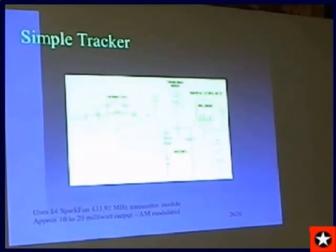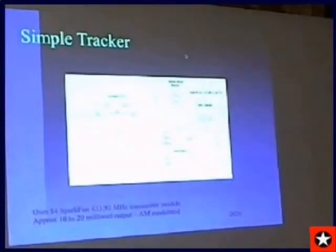Now the next thing is, I use a Kenwood TH-F6A to receive it with an arrow antenna on the ground, all you need. It does take a little bit more gain, however. That's the only drawback. I can also key it on and off as Morse code, so those that want a weaker signal work for that too. But this is an alternative and a very inexpensive tracker.